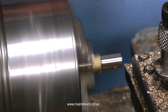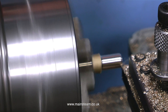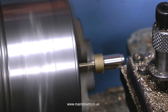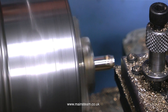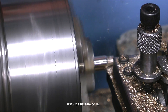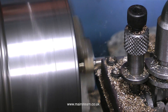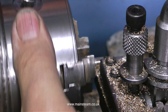As I mentioned in the last video, this lathe tool is damaged — you can see that there's not much of a tip on it — and I'm holding the part very lightly by the thread. As I take the cut the part jumps out of the chuck, damaging the thread. And this is mistake number four. Although I must admit I'm only carrying on for the purposes of the video. What I didn't mention is that when I drilled the cross hole I drilled it too deep. So then when I machined the diameter down, instead of having one nice hole that would direct the steam up the chimney, there was a hole at each side. This is no good at all.